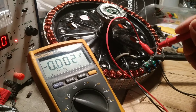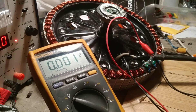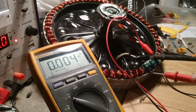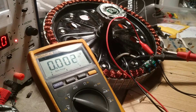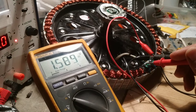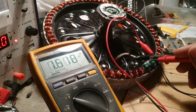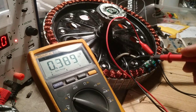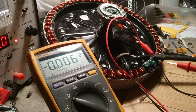So I've just checked each hall sensor. The wire — the green, the yellow and blue coming off — you check if there's any voltage on there. There's no magnet on there so there should be no voltage whatsoever. The circuit should be open. But if you look at this, the voltage — it's 1.5 volts, 1.6 volts, 1.5. So you've got roughly 1.5 volts. There should be no voltage coming through here at all. Normally there's no voltage like that.